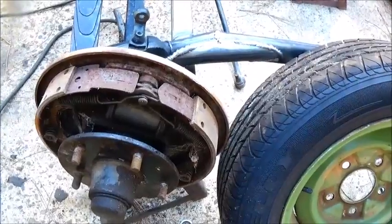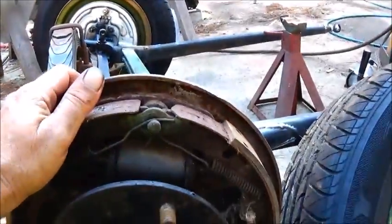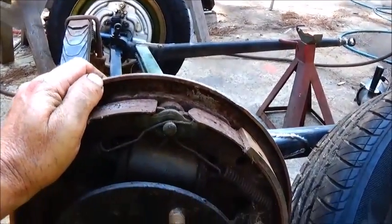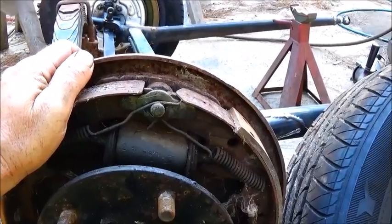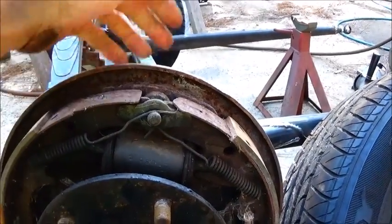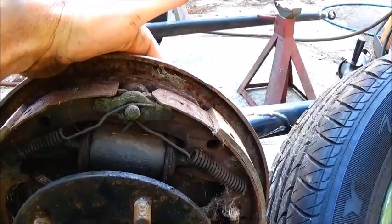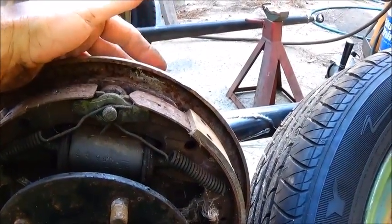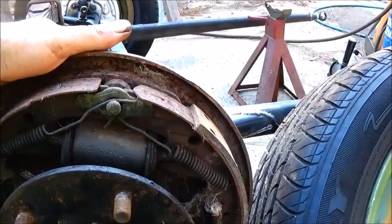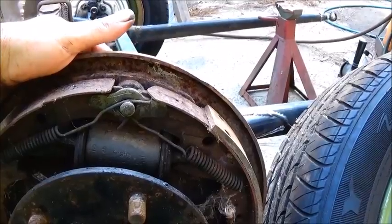get the parts, and the wheel cylinders wasn't available for the 39 and 40 Ford, just the kits. And I looked on eBay, and they were pretty darn expensive. And then I got to looking, and I noticed there was 3 bolts holding the wheel cylinders on a 39 and 40, so I knew something was off. So I actually took the backing plate number off these and did some checking, and finally found out that they're 53 to 56 Ford, somewhere through there. So 56 Ford was the same.